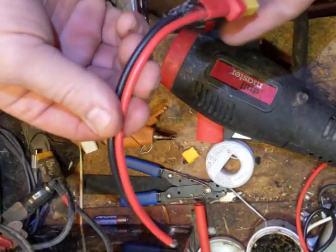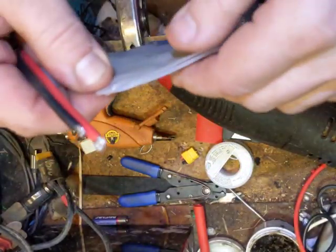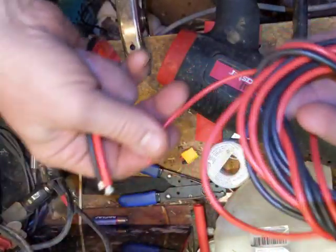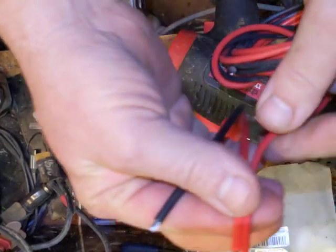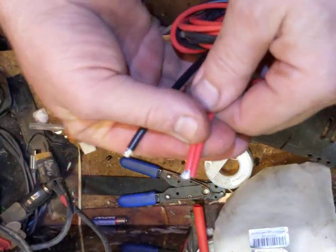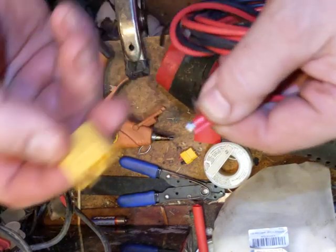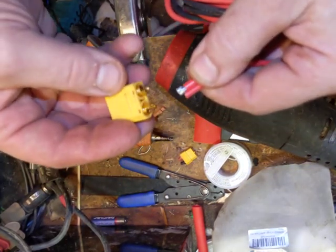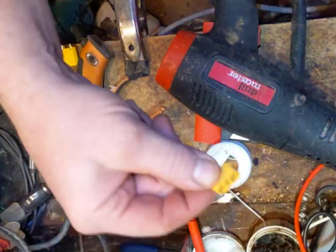Most of you are going to be putting connectors on here and not building a splice. What I'm going to do — off camera because it would take too long — is exactly the same kind of procedure but with this smaller 14 gauge wire. You can see how much more flexible it is, but it's still strong. I'm going to tie this wire in here several times and make a nice big fatty splice that will still solder on to the XT90 male connector. But absolutely I won't be able to use that collar — it just won't fit, but the heat shrink will.